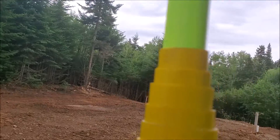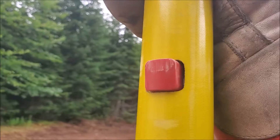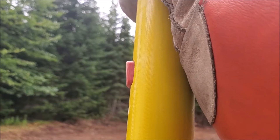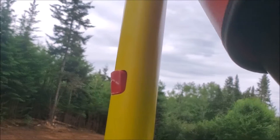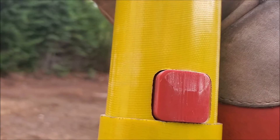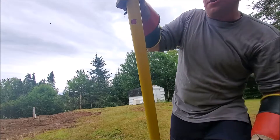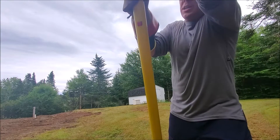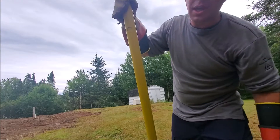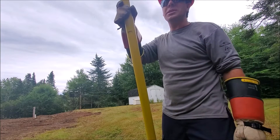Another good practice: as you're extending the stick and it's locking in place, make sure each button is fully locked and in place. These particular sticks are notorious for catching the side. If that button's not clicked and you use the stick to close a cutout, the stick will actually collapse without fully closing the cutout door, resulting in probably a pretty good sized arc from the cutout.